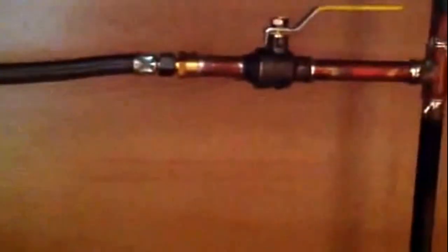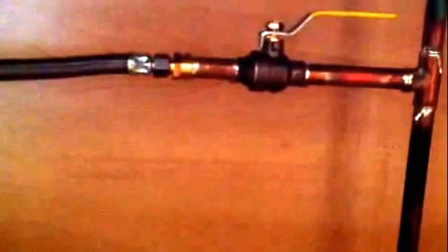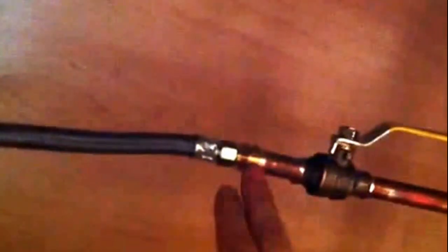I want to show you a dishwasher hookup. Always put your dishwasher on a nice small valve. You have to add a tee to your hot water line, and there's also a shut-off for the sink. Add your tee and then valve it.